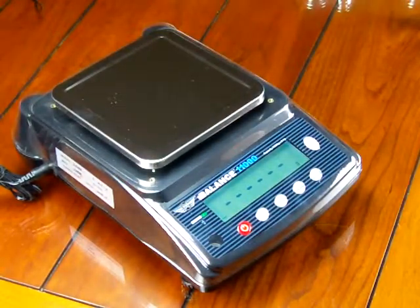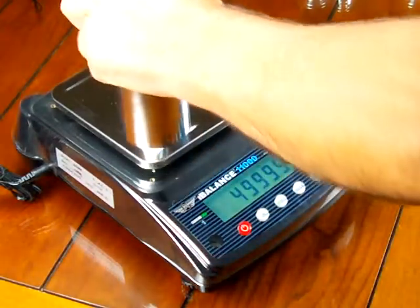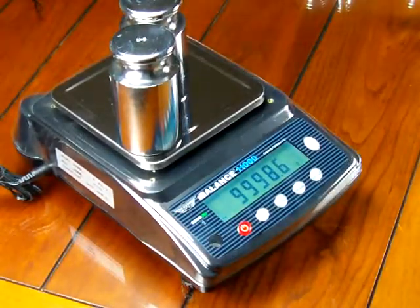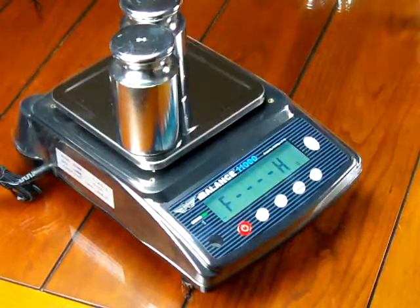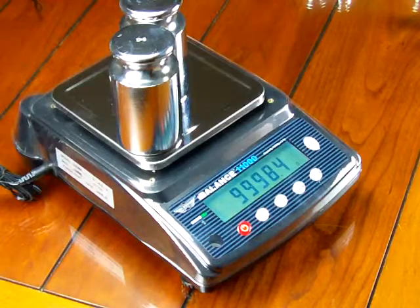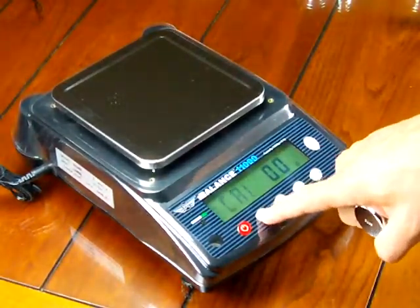If I remove the weights from the platform and put on 2,000 grams, it's going to show up as 4,995 grams or 5,000 grams. Another 2,000 grams is showing as 9,998.6. If I throw on another 2,000 grams, it's going to show overload, thinking we have 10,000 grams on there, but we only have 4,000 grams. So you have to have the right calibration weights — if you go into cal mode and put on any weight whatsoever, it's going to store it as that value. So let's do the calibration again.